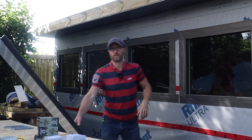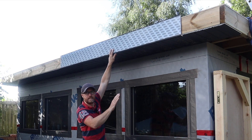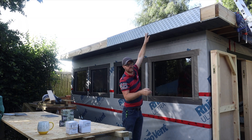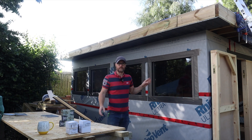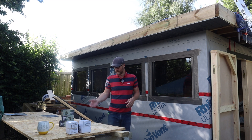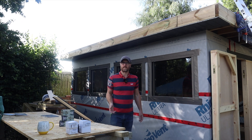The next thing we need to do is put the fascia on. I've ordered this stuff which is flat on the front, goes flush on the fascia, and has an overhang which covers the edge of the soffit to neaten everything up. When you're cutting your soffit, don't worry if you're a couple of mil here or there - as long as you're not proud, it's not a big issue. This is the first time for me doing this, same as many other jobs, and if I make a complete bodge of it, it's better that it's on the back or a side away from vision. There are special ring-shanked nails that come with the kit so they don't come out - I'll put a link in the description for all of these things.